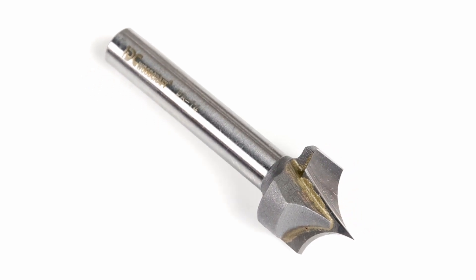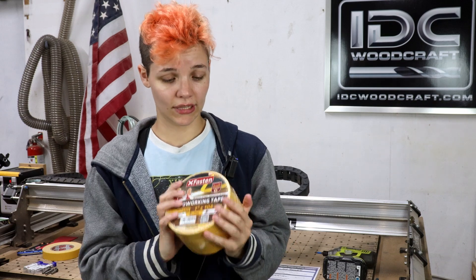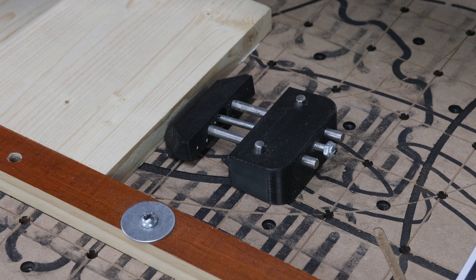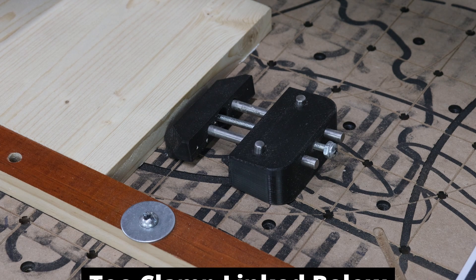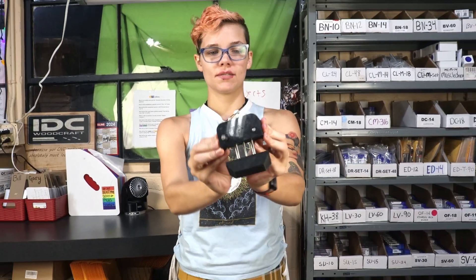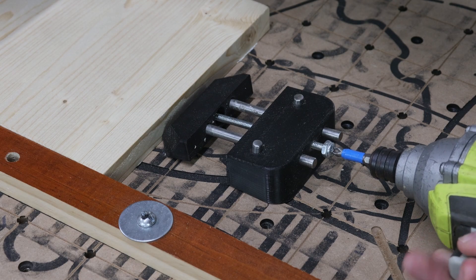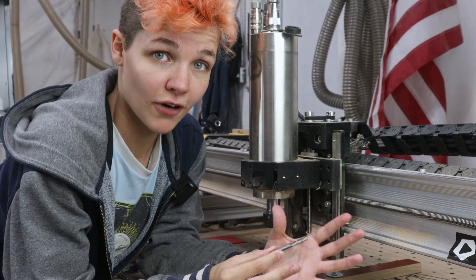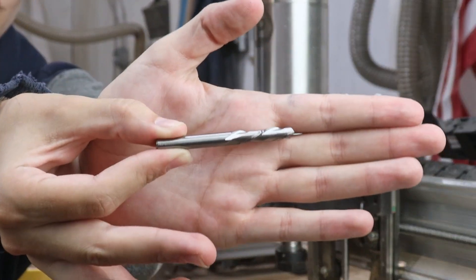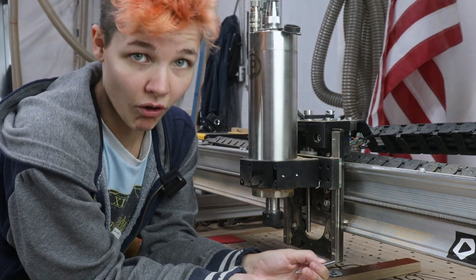Today to hold down our project I'm going to be using X-Fasten woodworking tape. I need that to free me up from clamps when I'm doing the outer edge, and I know with this it's going to be held down tight. The other hold-down method we'll be using today is a toe clamp — I'll have a link in the description below to where you can get yours. This is my current favorite hold-down method. It allows me to quick-change a lot when I'm doing the name signs with just a drill. For our first carve today we're going to be using a one-quarter inch down-cut end mill from IDC Woodcraft — you can get that on our website, and I'll know if you order because I handle all the packages.